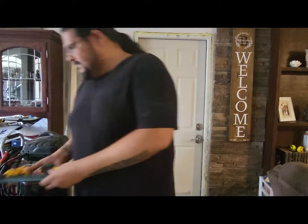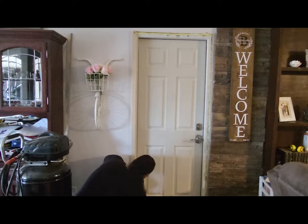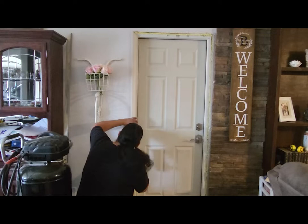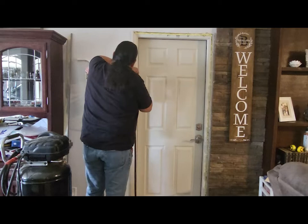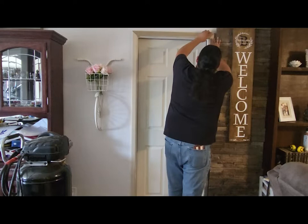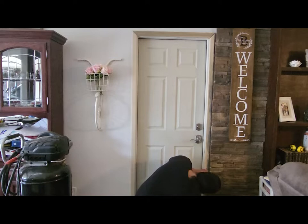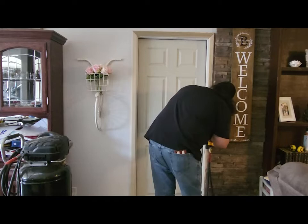I decided the best way to go about this would be to start on one side, work across the top, and then finish the other side. The left side went on without any issues, then I tacked down the top on that side, made sure it was level across the jamb and lined up with the trim on the right side. The right side was where I had the most concern due to the bow in the board — I started at the bottom, worked about halfway up, then pulled the board into the proper position on top, nailed it, and nailed it the rest of the way down. It ended up being much easier than I anticipated.